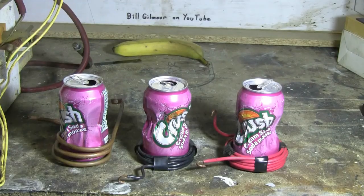Here are the results of this can crushing experiment. The can on the left is shown sitting in its two and a half turn coil. Two shots from the cap bank only dented the can a wee bit — the first shot did nearly nothing, and the second one creased it a little. The middle can, sitting in the five turn coil, appeared to get the most crushing of the three, with only one shot. The can on the right, crushed in the ten turn coil, appears to have crushed slightly less than the five turn result.